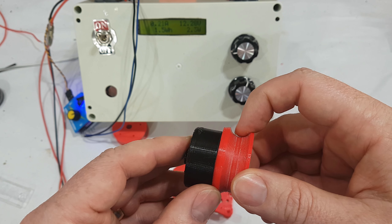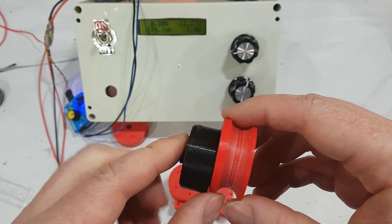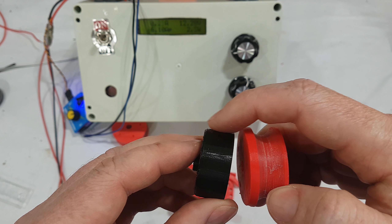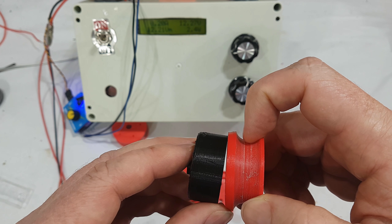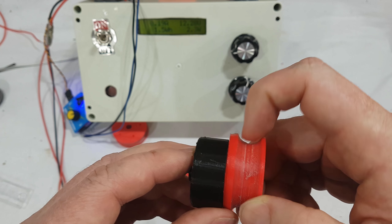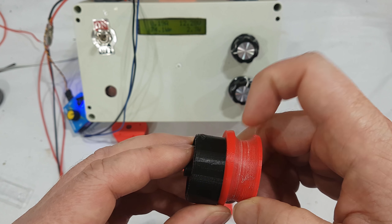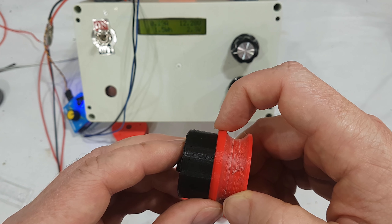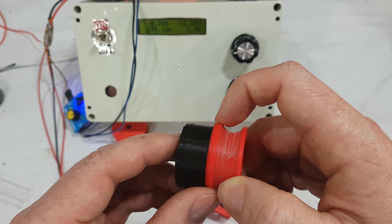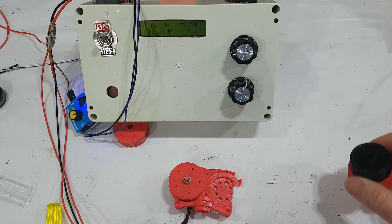I'm very concerned because you're applying a lot of pressure on the side of this by applying a wheel to it, and that could bend it away and create problems. The reason for such a high KV rating is because of the wheels. This wheel has a larger outside diameter but a smaller inside diameter. So to have the same surface velocity on the inside I needed a higher KV rating and therefore higher RPM, because this is a smaller diameter.